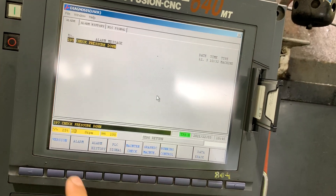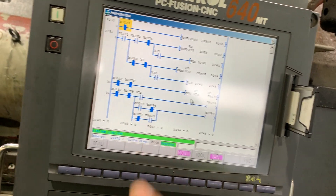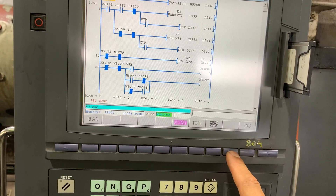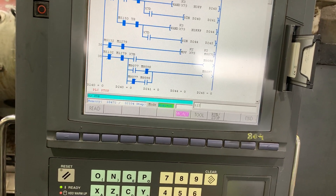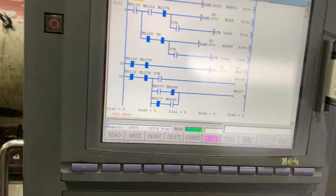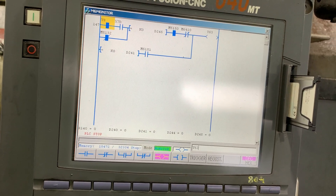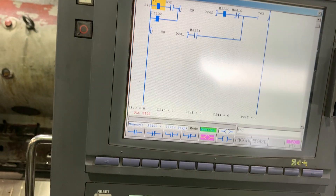Press the left arrow key and go to Diagnosis, Version, Ladder Monitor. Let's stop the PLC, then enter one input. Hit the empty soft key and the right key, then enter 1131 as the input. Now we have the option to write and modify the PLC. Let's monitor output Y63, which is this LED.